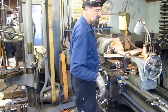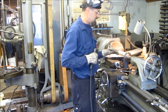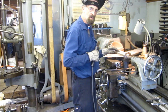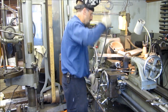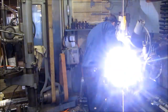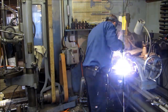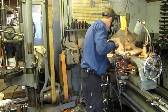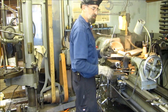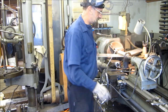Now also, if you got one of those hands like Gene Wilder in Blazing Saddles, grab your rod with your other hand, guide it into where it needs to be, and then initiate your arc, and then you can weld from there without accidentally stabbing it onto a part or another part of the machine that you don't really want to damage. Take your rod out. You got to go over there and weld on that side, take your rod out. You could accidentally put it over there while you're walking around the end. Your rod could flip around and then arc off of another piece of equipment there.